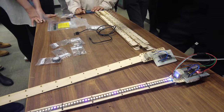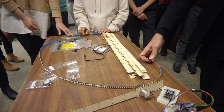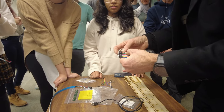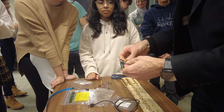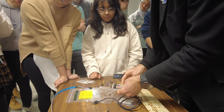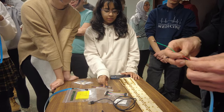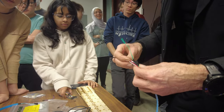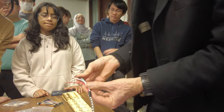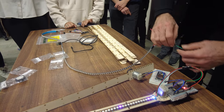Let's get the colors — a zero, a two, and a five from here. So zero, two, and five. I'll take a zero and a two, and a five from the end. Clock and data is color five which is green, plus five is red, and ground is black — I'm using black wire because it's more common for ground, even though ground is white on the light strip.